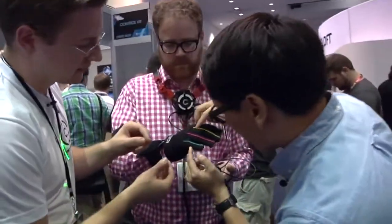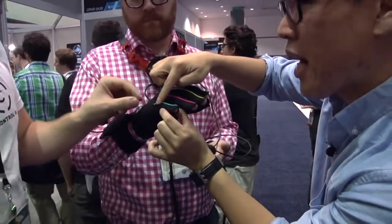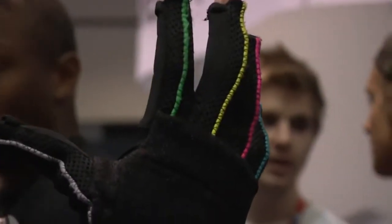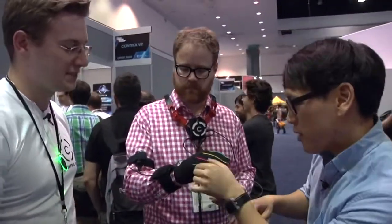In this glove there are sensors underneath each of these fingers — you can actually feel them. They're about a half inch across. The big breakthrough to make finger tracking possible like this was getting the sensors down to the size where we can get it onto your pinky finger, and it needs to sit on top of that finger. Two sensors on the thumb as well, so there's actual finger movement. In order to establish presence, like in the Moon demo, the latency has to be low.